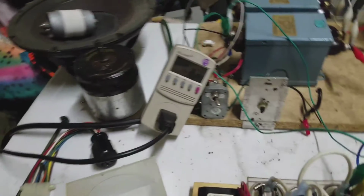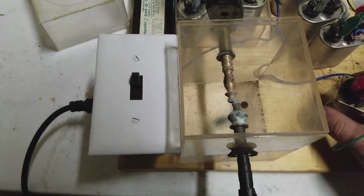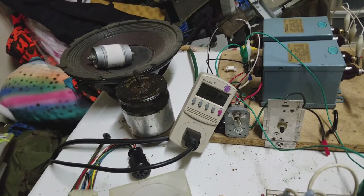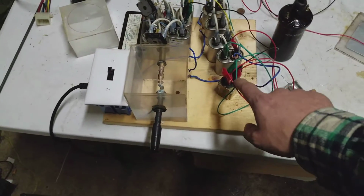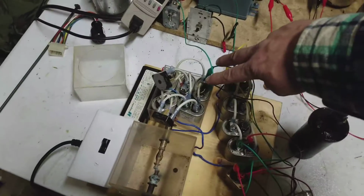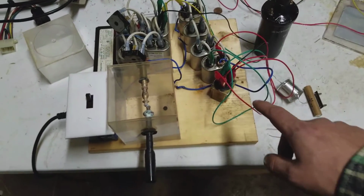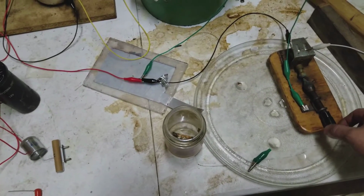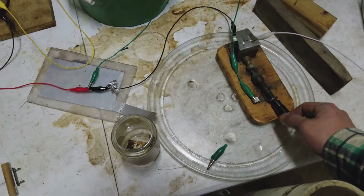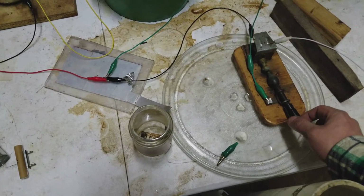This whole setup's using 0.17 amps, 18 watts, and once it runs, the power factor hovers between 90 and 98 sometimes. When I hook it with just the coil of the relay directly across the output of the Tate, the circuit still oscillates, and the power factor goes up to 0.98. But I don't get as strong of an oscillation. It's probably only half of what's going on here. I'll have to get it up really close, and it's just a real fine purple arc, whereas this definitely has a lot more current in it.